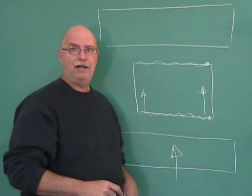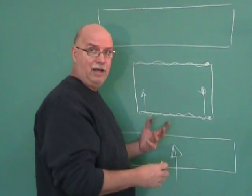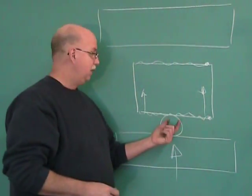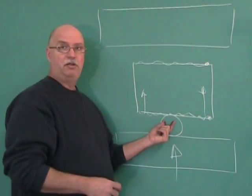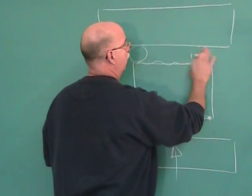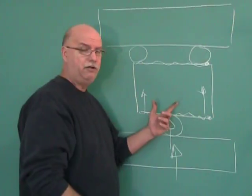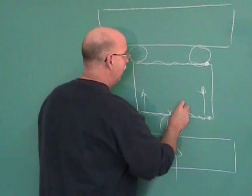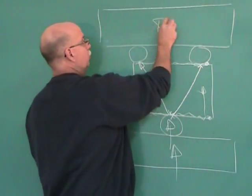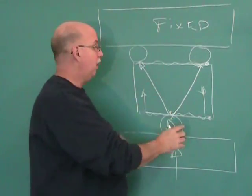To ensure that we get good contact and an even dispersal of the holding force, we're going to use cylindrical sleeves. And for that, we're going to put a piece of brass, in this case, or mild steel, with one piece of steel at this end. It's just a little piece of half inch or three quarter inch bar stock, brass half hard. And on the other side, we're going to put two more. So one here and two here. This is the side that has the force applied to it, and this ensures that the force from here is going to be spread out evenly over the whole of the secondary surface that comes up to my fixed jaw on the vise, and that this will be a stable way of holding the part for this first cut.